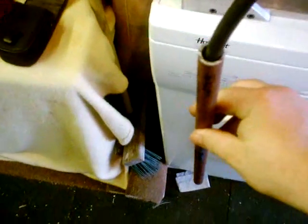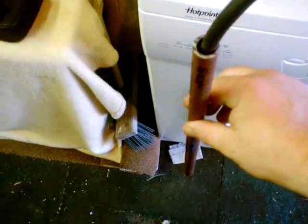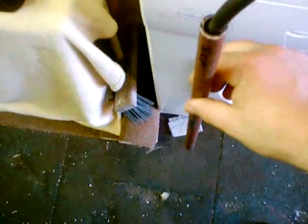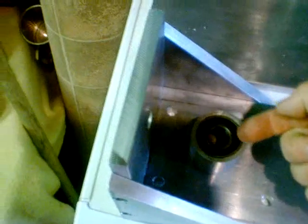My idea with this one is to feed a very large tube down from the 50mm pole up into the centre of the turbine. That will be fixed on the 50mm pole, protruding up through the centre — stationary. The wires will come out at the top, and hopefully there will be a bearing in the top holding it firm, because there will be two bearings in the bottom anyway. The brushed gear will sit at about four positions — it depends on what rim I've got.